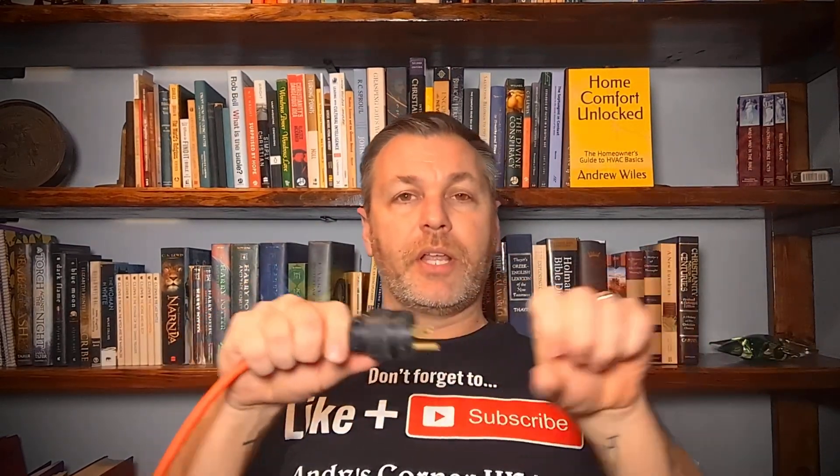You're going to put all this in a box with a nice cover on it. You'll have this little cord hanging out with a male plug, and the exposed prongs can freak people out — but there's no power there even if the switch is up or down unless a generator is hooked to it. What I do is I get a female plug too and just plug them together. That way whenever you bring your extension cord in, you just pop the extra female plug off, your plug is exposed, and you can plug it in and restart your furnace.